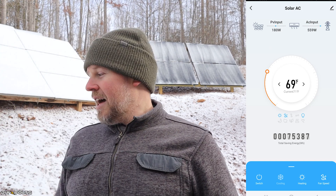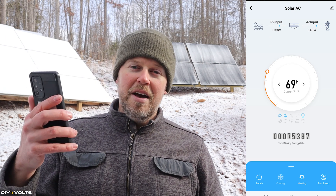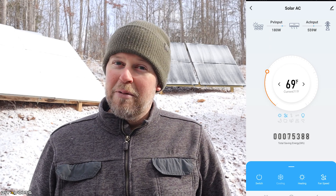This is a 12,000 BTU mini split and my house is 1,900 square feet. I've found that on a day that's about 35 degrees outside it will heat the whole house no problem. On a day like today at 20 degrees outside it may struggle a little to keep up to temperature, but to be honest it has done fantastic. I have this blowing directly on my thermostat for the house HVAC system. I can use the app, and as soon as the sun goes down behind the mountain I can turn off the mini split, the house will cool down, and the thermostat will kick on my normal AC system. It works out pretty well.